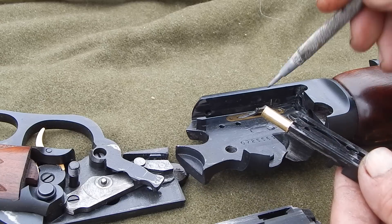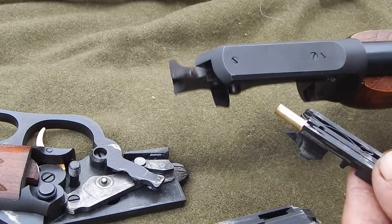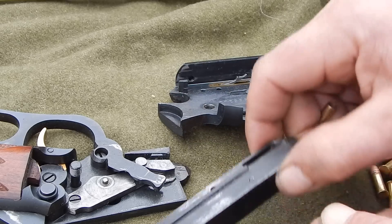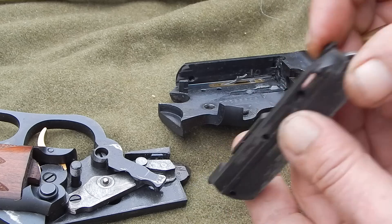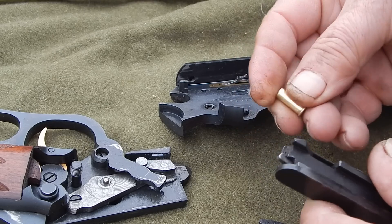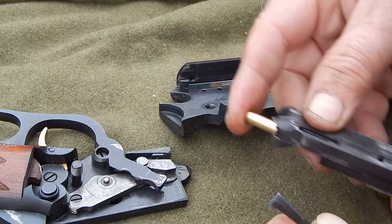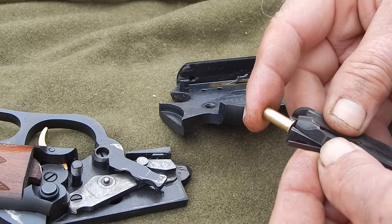This one is held in place by two screws on the back side — that's not the normal Marlin way of doing things. What I've got here is a bolt for my .22 Magnum, and it will be easier to show you. On this it's a little bit bigger and they've got a much heavier, stamped piece. But that extractor holds that in place. Then when the bolt comes back, the ejector is riding right along here and it catches it and kicks it out.